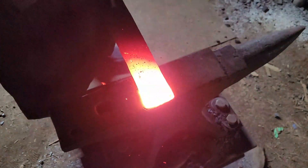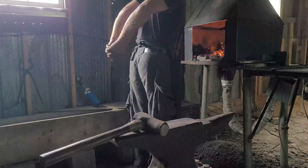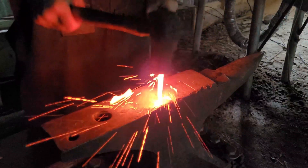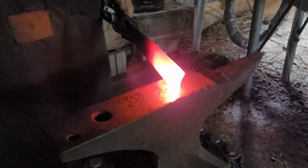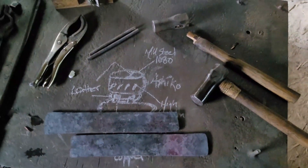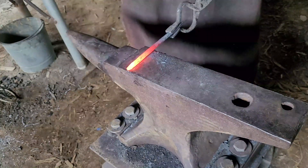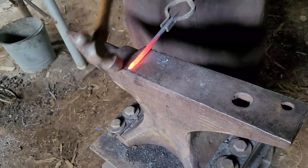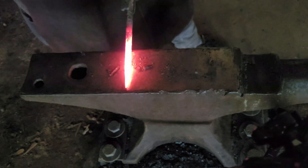That's done on both sides on both pieces. It's a wedge shape so the energy is distributed — that's a better way of saying it for the forge welding process. With a lot of energy in them they're hard to see, but in this form they're ready to go. Now I need to make the teeth. This is a high carbon steel and I'm going to draw each one down to a sharp point — well, about a sixteenth.